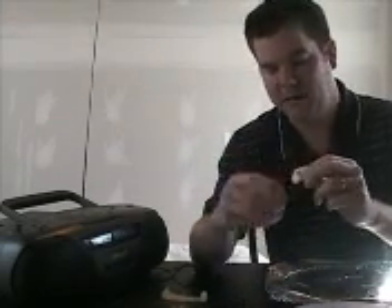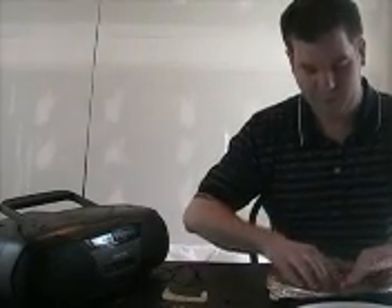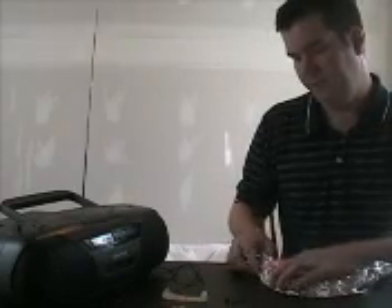One thing that the high-definition speaker on YouTube did not have is a permanent magnet. I am using rare earth magnets — they're very small. You can see the pennies right here and the magnet is a lot smaller than the penny. I'm going to take my rare earth magnet and tape it to the bottom of a piece of aluminum foil, then wrap the paper plate with the aluminum foil with the magnet attached.